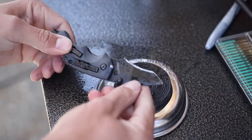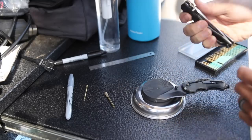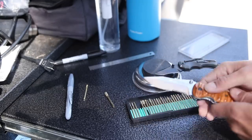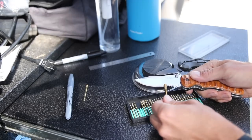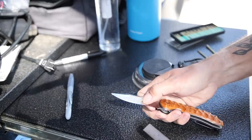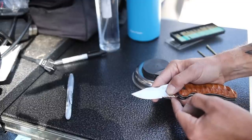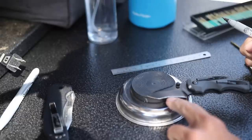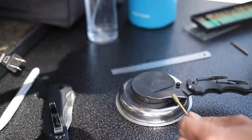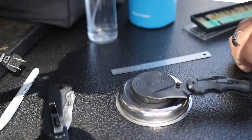Now that's actually looking pretty good — it's time to actually cut in our serrations. I've decided to follow the same serrated pattern as my Ontario Utilitec. I pulled out my diamond engraving bit set and found the correct size for each of these scallops — one is perfect for the bigger scallop and another for the smaller scallops. We're going to measure from the center of each scallop to the next, so our pattern is going to be: 1/8 inch, 3/32 inch, 1/8 inch, 1/8 inch, 3/32 inch, 1/8 inch. We'll mark where to cut with a small divot from the cutting wheel, then grind out each scallop. One thing I've noticed: when grinding your scallop, it ends up just a little bit to the right of the divot, so we'll mark our divots a little bit to the left of where we want the actual center of each scallop to be.